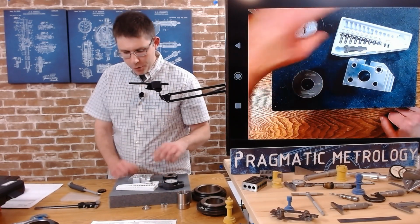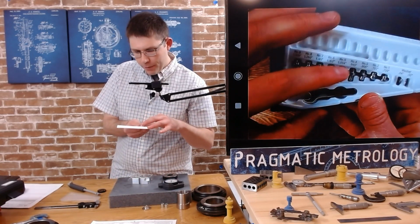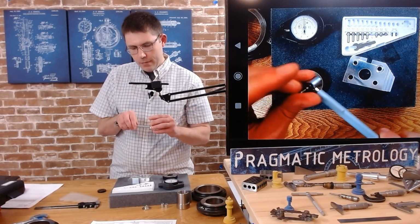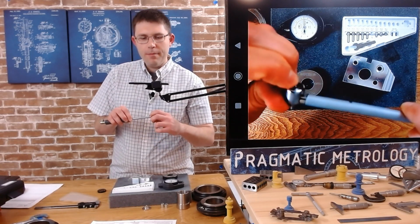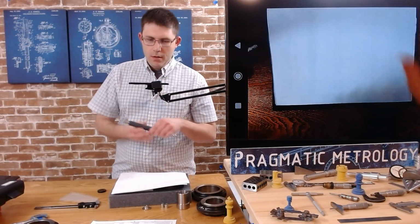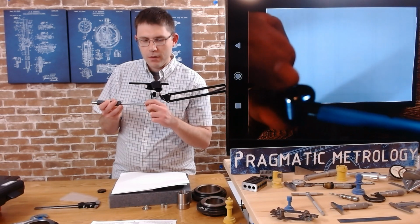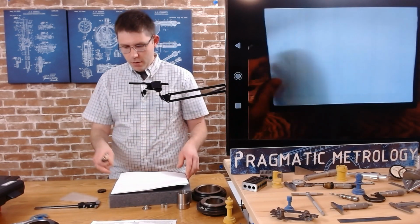So we're trying to hit 970 and 1 inch for the calibration. So this 945 looks like a good one to start with. So I'm going to grab the 945 and we'll screw it in. And once again, this nub back here is what engages with the part. Take a look at this other camera right here. If you can't see it well on the TV monitor there, it's hard to get it into focus. That little nub is what's going to ride on the part.